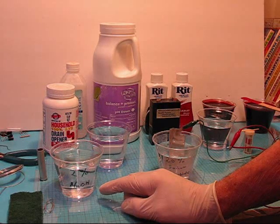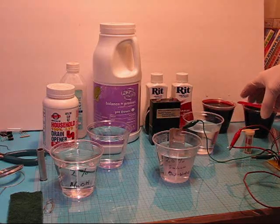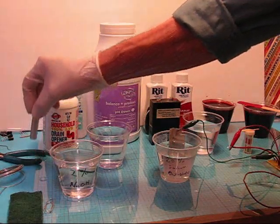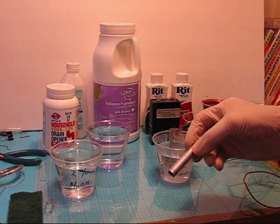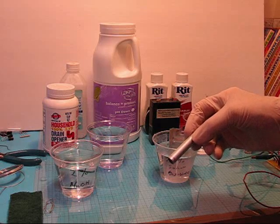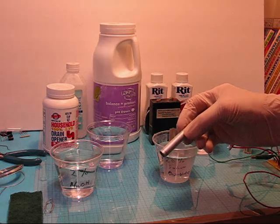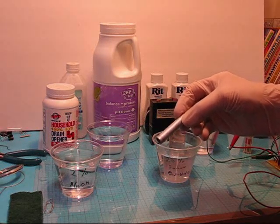So the sodium hydroxide is an alternative etching step. I'll go through it quickly — then we have a rinse and then the dyes. I'm not going to go through the whole process since you've already seen what I've anodized. A couple of key details: one of the keys to good anodizing is the cleaning. One correction — this is actually an update from my original video. One mistake I made in that first video was using steel wool, which should not be used as it can embed iron in the aluminum surface.